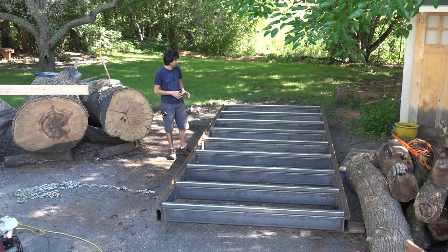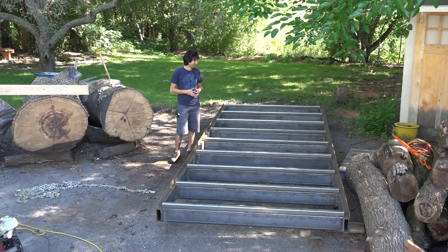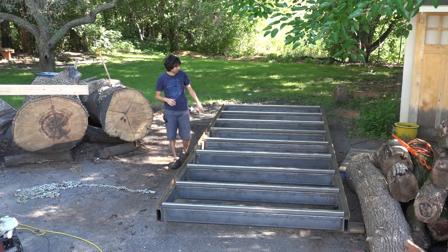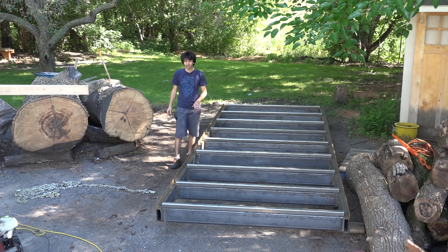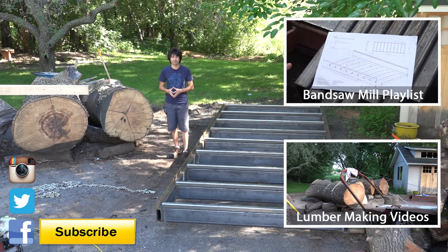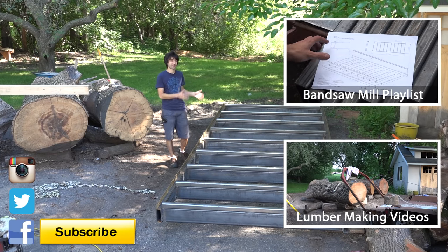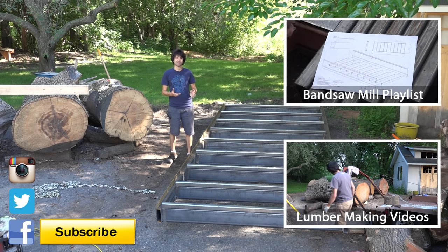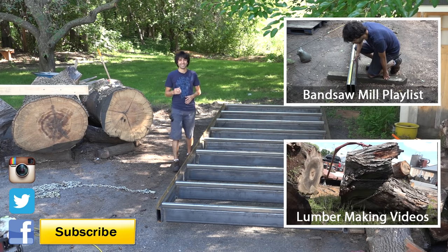In the next video we're going to start drilling holes again — except this time they're not going to be as ridiculous, and I've learned a lot since the first time. All of these runners need to get drilled for the bolts to hold them down to the cross pieces, and I'm also going to bolt the rails down to the side beams to allow them to be replaced, shimmed, or moved as needed once we build a carriage. So that does it for this one. Thank you as always for watching — if you have any questions or comments please leave a comment, and until next time, happy woodworking.